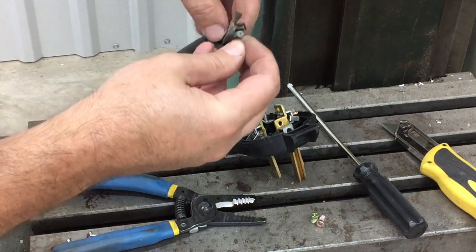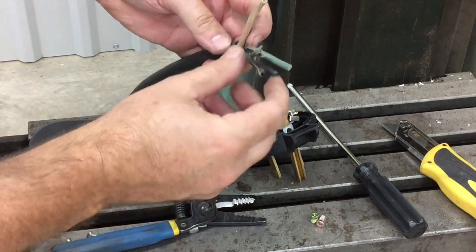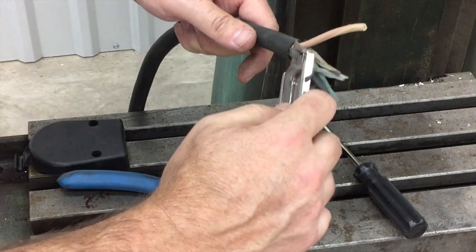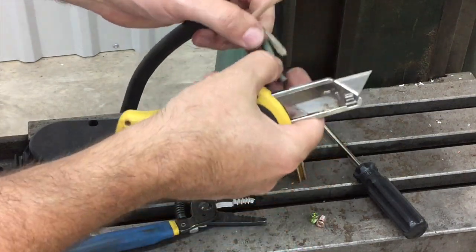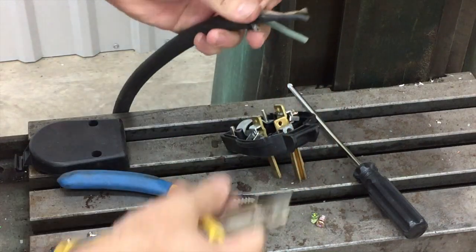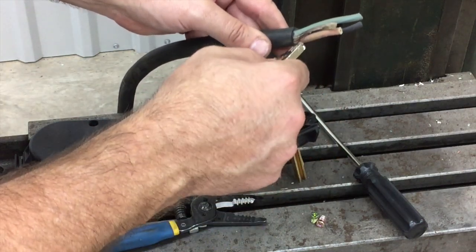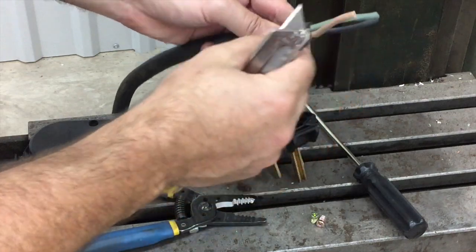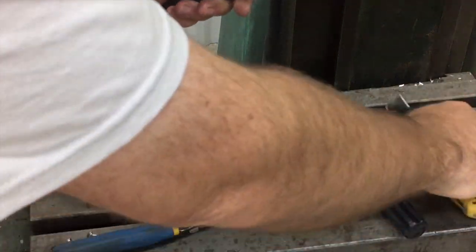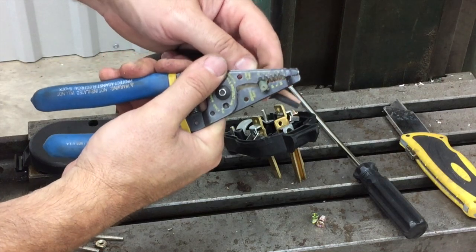This is probably some pretty old wiring on this machine, but as you can see we have a green, black, and white wire — sort of a pinkish-colored wire. We'll get rid of the sheathing to get it out of the way. You'll see L1 and L2 referred to — that's Line 1 and Line 2 in a 220 single-phase setup. We want to strip a little bit of the end of the green wire because it's going to go in first. It's got a coating on it as well — we'll get rid of that.